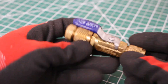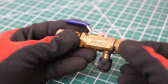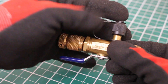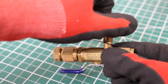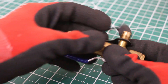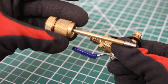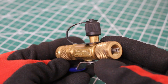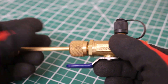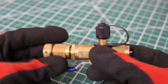Let's take a quick look around the tool. We have a ball valve here — as you can see, we have the handle. This is the part that will get attached to your circuit. They have gaskets inside. We also have a quarter-inch port, which is where people typically put a micron gauge when pulling a vacuum. If we unscrew this, we have the core valve removal tool. When everything is attached together, we can pull this in and out — this part stays on the fitting and we work this inner tool. So we can pull it out and, at the same time, use this valve.